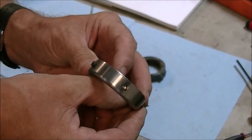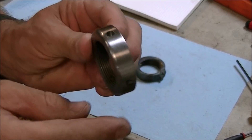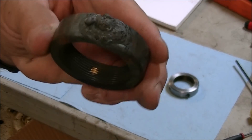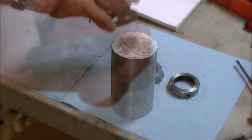Welcome back to part two of the Hendy headstock repair. On this part I was able to TIG weld in the buggered up pin wrench hole and recut it. I tried to do that with the second one and the third one, and then realized that I was out of gas for the TIG welder.